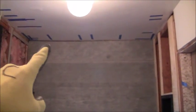All right, the back wall is completely done. The toughest cut was the one here at the top because the ceiling has a huge bow in it. I put the cut edge up against the ceiling. There's a pretty good size gap there. Because that's probably not going to receive any water, I'll just end up filling that in with joint compound because it's right up at the very, very top. So anyways, that's that cut.